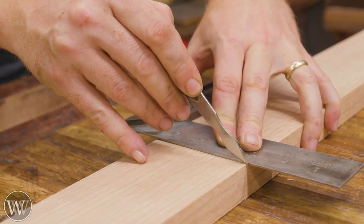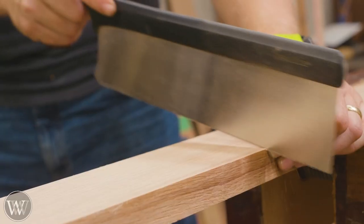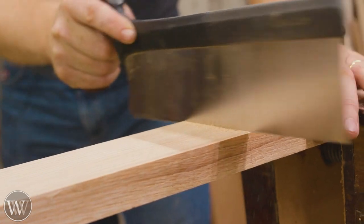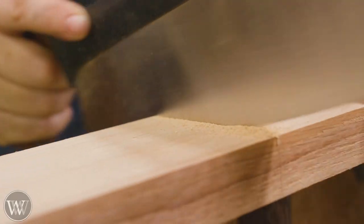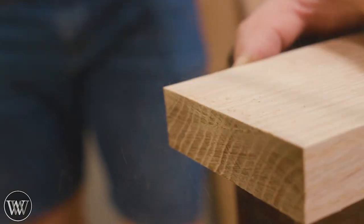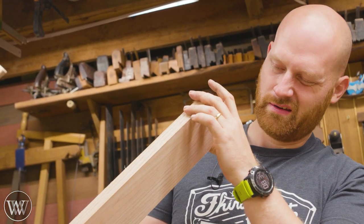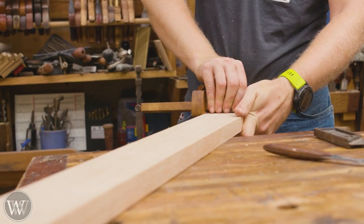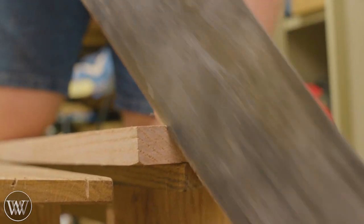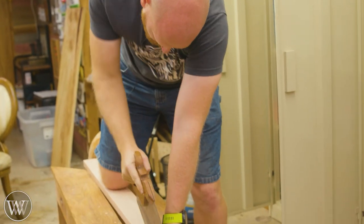We're gonna make the beam out of oak — a piece of red oak that is a full four quarters thick, so it'll make a pretty solid beam. I wanted it to be about four feet long, as that's the length I really like clamps to be. I don't use longer than that very often, but when I do I can always make a longer beam. I'm going to cut it off to four feet. It was three and a half inches wide and I don't need it quite that wide, so I'm going to rip it down to about two and a half inches.